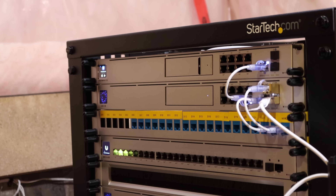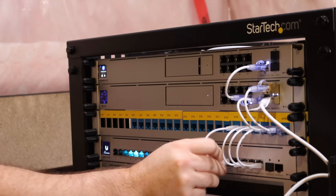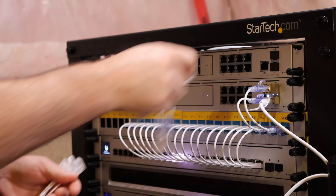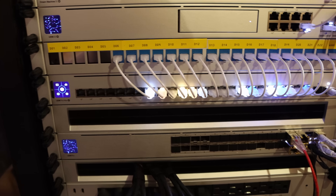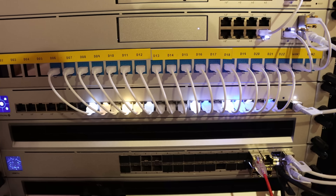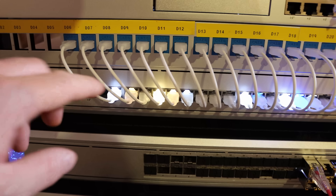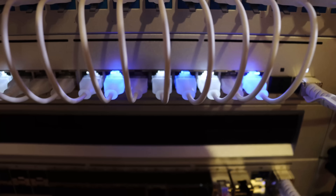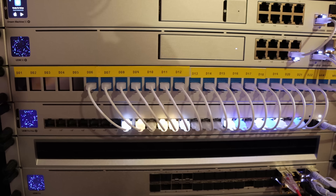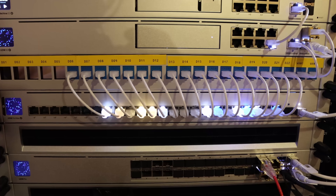We have the switch powered on, and you can see the RGB going back and forth. Now we need to get the Ether Lighting cables plugged in. You can see the USW Pro Max PoE in the rack and some of the RGB is currently glowing. Right now it's showing us our port speed — white lights mean gigabit or 10 gigabit, amber lights are 100 megabit, and blue lights are 2.5 gigabit. We can also change the color on the SFP port. Another thing we can do with the RGB is set it to a network — so we could have our camera network be blue, our VoIP network be red, and so on. We'll take a look at that in the software.